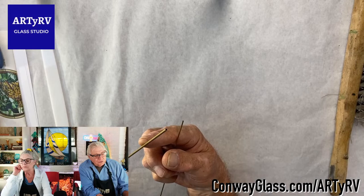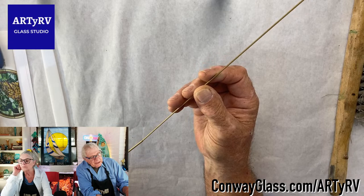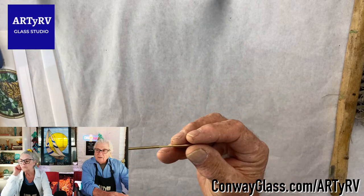I did have a question come in this week about the video about the hinges. The jewelry box hinges? Yeah, we can talk about them. I've got a set right here on the table with me. So the jewelry box hinges that we show in the video making the jewelry box are a two-part brass hinge. One of the hinge parts, the brass tube, is about 3/32, and then the other part fits inside that diameter and is just a 16th of an inch. So you have these two that work together like that.